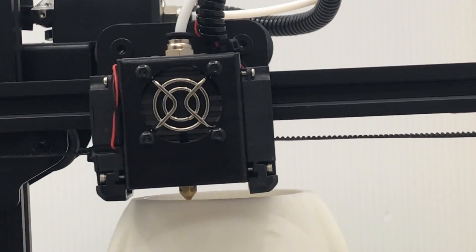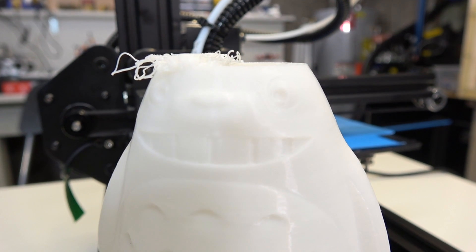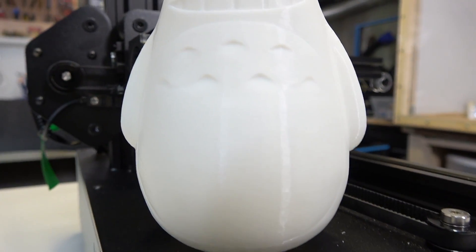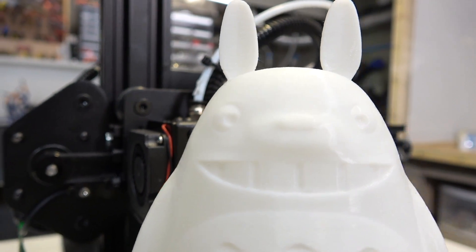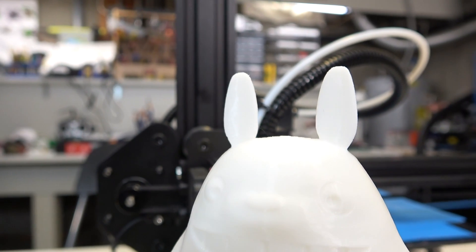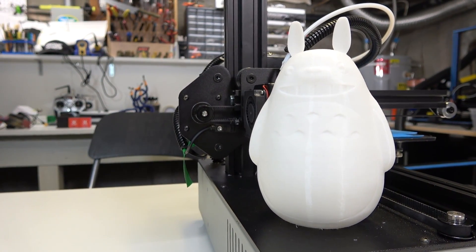On my second try I wanted to do it during the day to babysit the print and make sure it didn't pop off the bed — but something else went wrong again. I figured it out on my third try: a wire in the back was snagging on the Z axis. The Z-axis wire was catching on the back of the printer, preventing full extension. What was happening is it caused the print to stop at the same point every time, about six hours in. Be careful about wires hanging off the back — the linear bed needs to move freely and will snag.